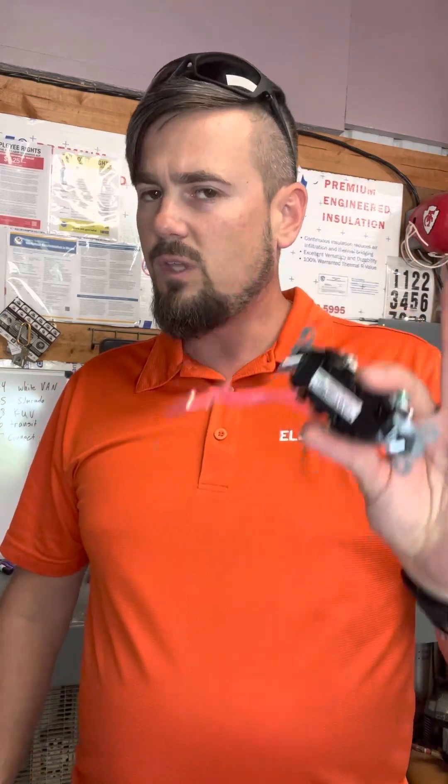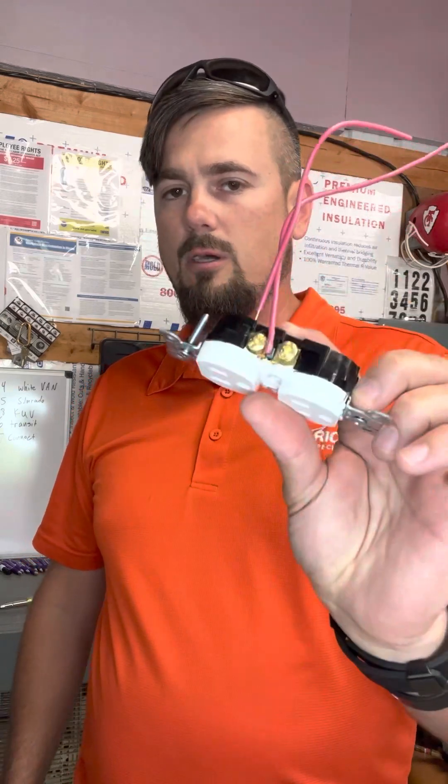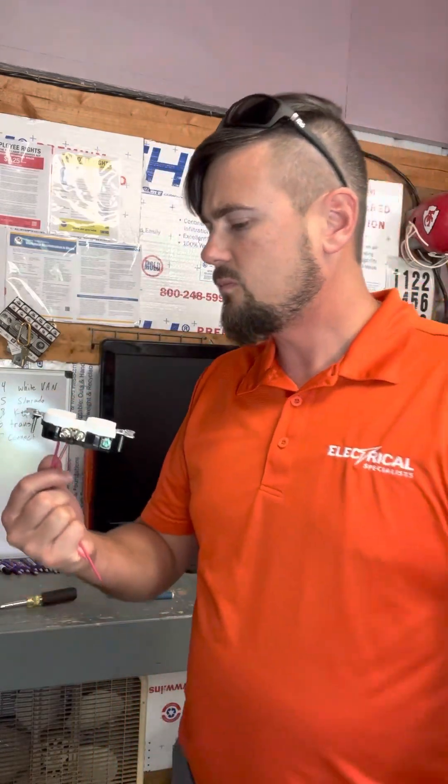I would say: check your devices. If you feel safe enough to pull one out of the wall and they're backstabbed, and you feel comfortable shutting the power off and wrapping around the terminal, please do it. If not, give us a call or give somebody else a call and get it done. It's a simple way to make your house a lot safer and it won't cost you anything if you feel comfortable doing it. It doesn't cost that much to pay someone to do it. Hope you guys have a great weekend — stay safe, and if you're going boating make sure to stay on the boat. We'll see you Tuesday!